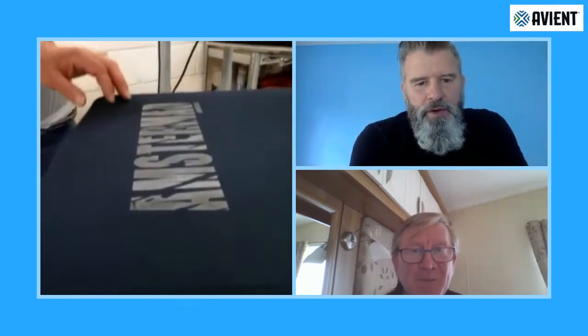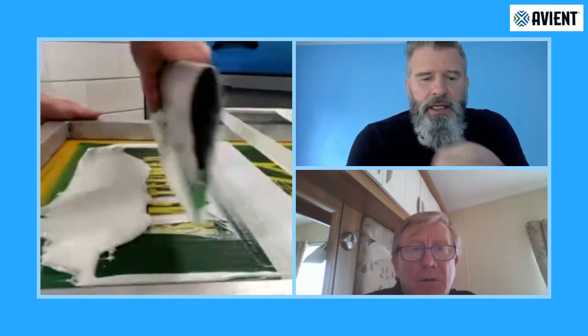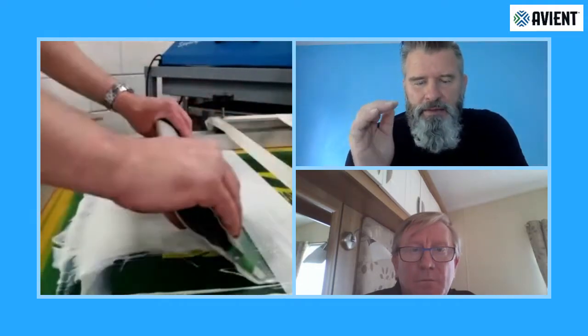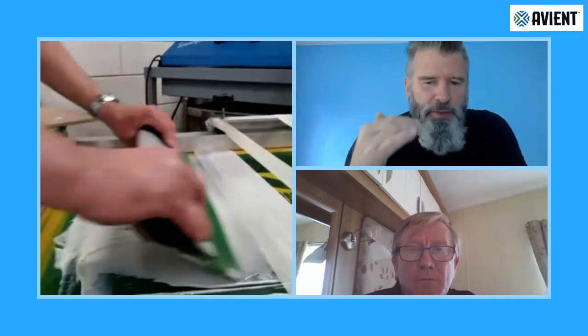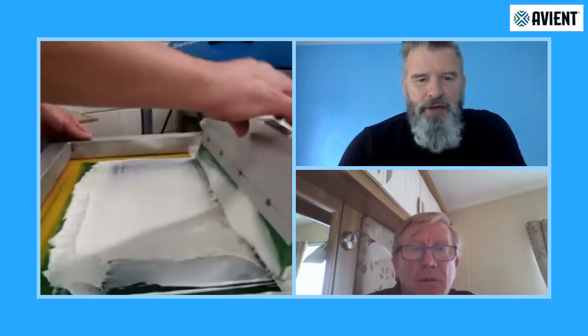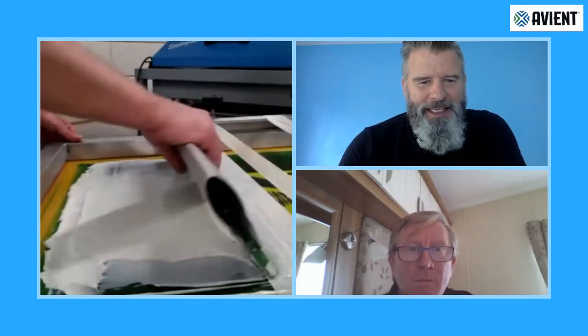Well, we've used that technique too before, where we do a print, flash, print of the HD clear. And sometimes we have some of the sharp clear mixed in it, to make it nice and flat. And you can get like a 305 mesh, which would be a 120 over there, and print it very lightly and put super high detail on top of it because you're actually printing a very flat surface. Yeah, exactly. So now we're making a mess. See what happens. No, it's not good yet.